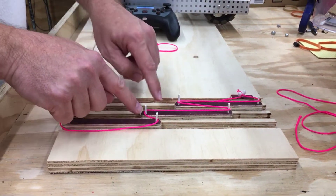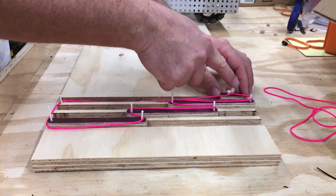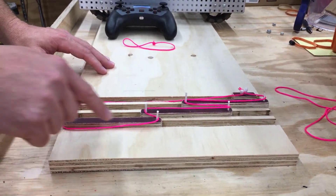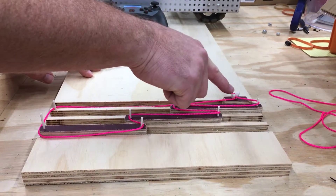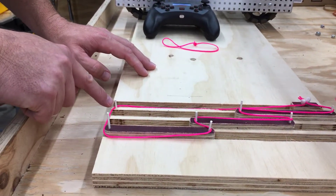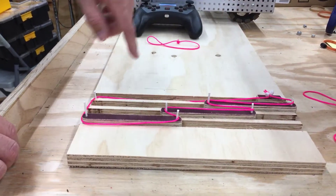Here's stage one — two is stopped. Three could move up a little more, but we're running out of room. Four is pretty much topped out. But you see the chain path: bottom of one, over the top of one, under the bottom of two, over the top of two, under the bottom of three, over the top of three, attached to the final stage. Back down to your dummy sprocket, back under, and so on and so forth. It's a continuous loop of chain.